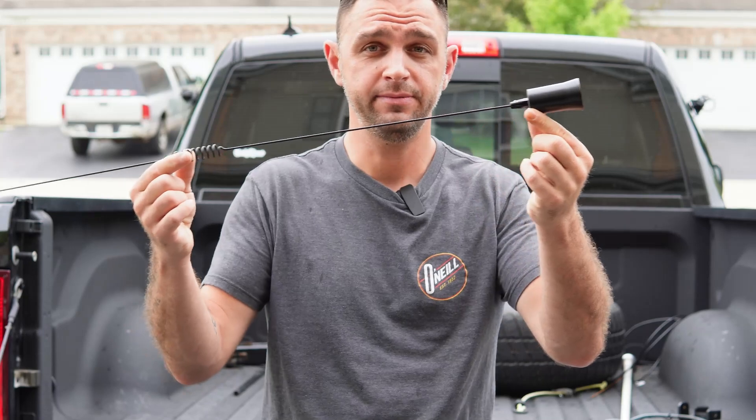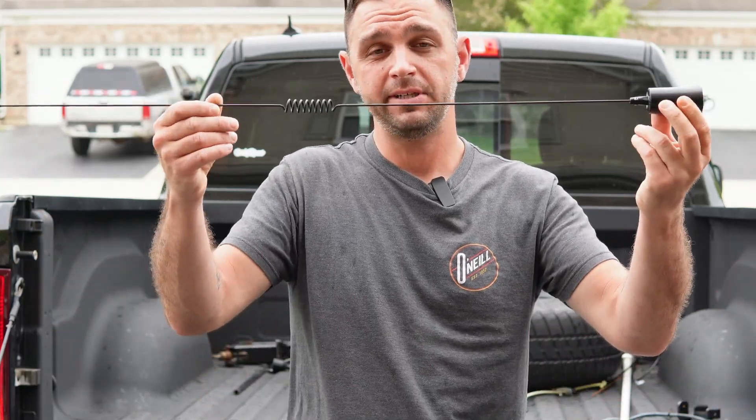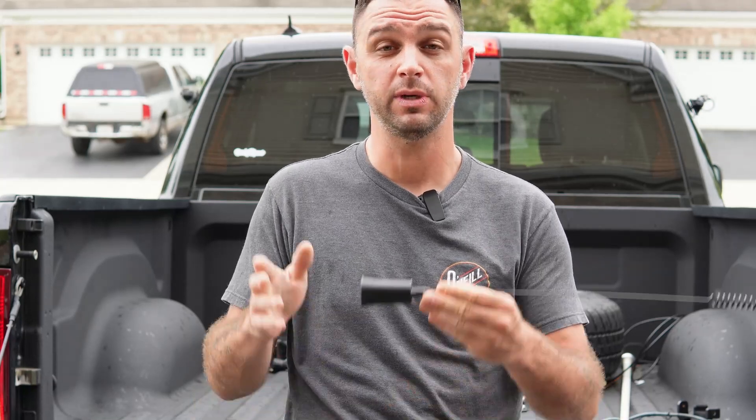Once fully installed, this Larson Antenna doesn't have much to it. People might ask where it's made — at least this one is made in the USA. Not only this one I tested, but each and every current Larson Antenna is made here in the USA. The gain on the 2 meter / 70 centimeter collinear is 1.6 dB on 2 meters and 3.5 dB on 70 centimeters — those are dBd values, not dBi. If you want dBi, just look on the website or add 2.15 to those numbers.